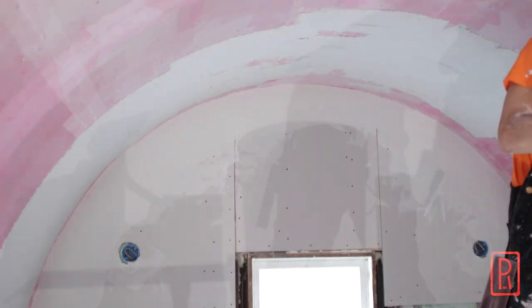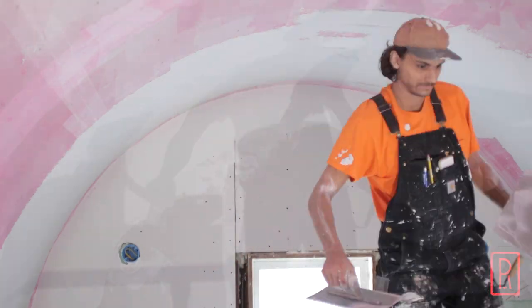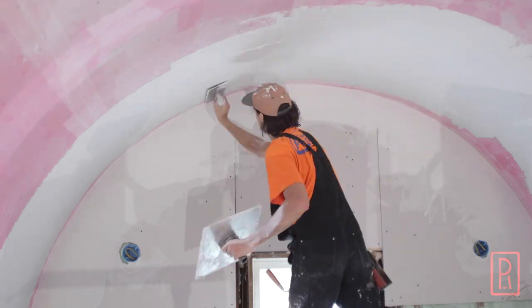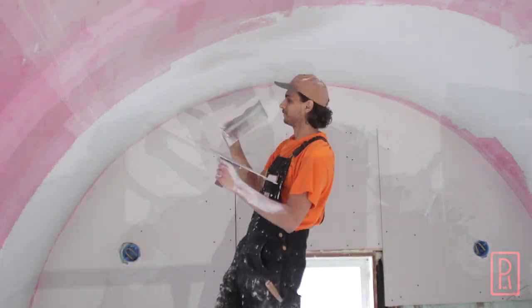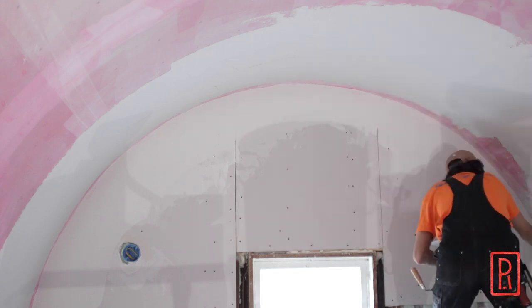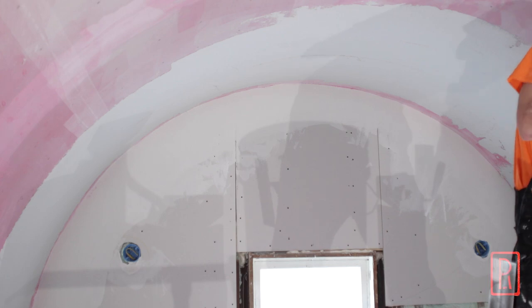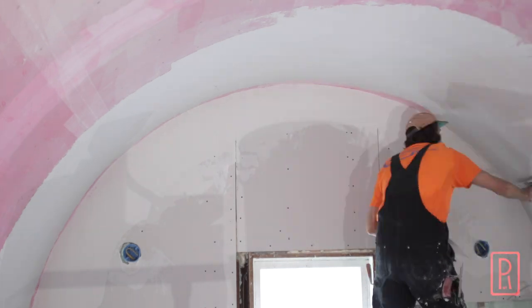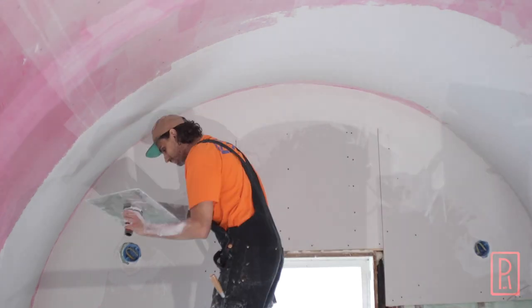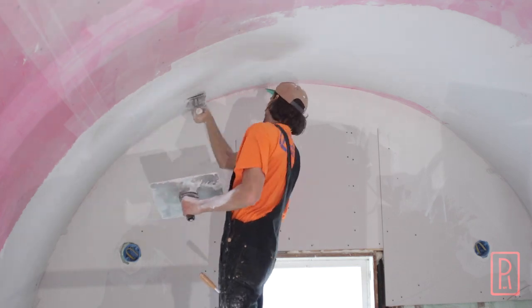I load my hawk with as much mud as I can, keeping in mind that I'm on stilts and need to make sure I don't drop too much if it's runny. Then I lay the mud on the wall roughly just to get it off the trowel. I spread it using my elbow and shoulders to mimic the curve of the barrel vault while keeping a constant thickness — this usually takes a few passes. I work from the bottom up on both sides, then connect the two sides at the peak of the room. Then I level each batch with a Darby, which is really just a large magnesium trowel with two handles.